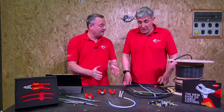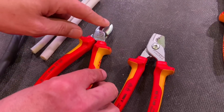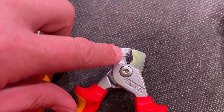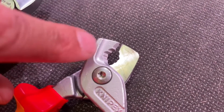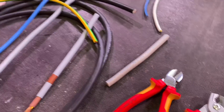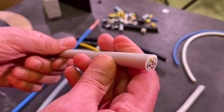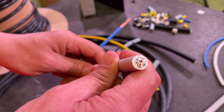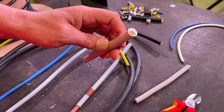Should we take a closer look at this step cutter? Yeah, let's have a look to see the difference between a regular pair of side cutters - there are some obviously with a straight blade - but then we'll look at the step cutter: it's got this serrated blade here, which is the key to that 40% effort reduction. It was designed to work on what's termed NYM cable in Germany, which is a common installation cable we don't use over here, so we'll try that on it first and then check it out on the cables that we use.